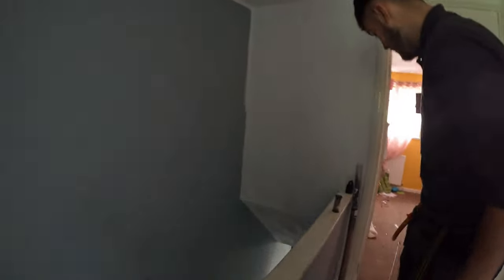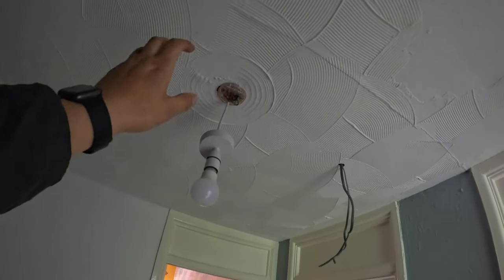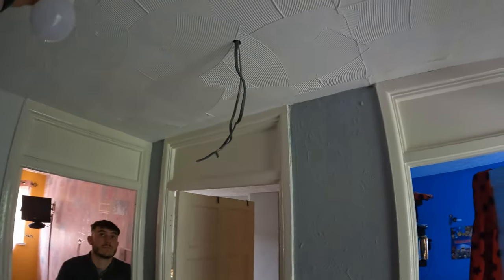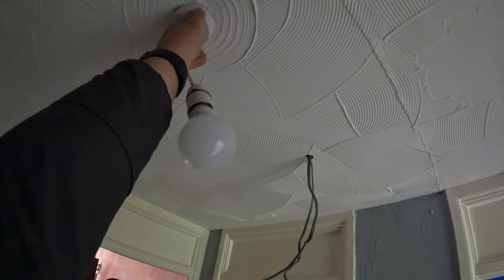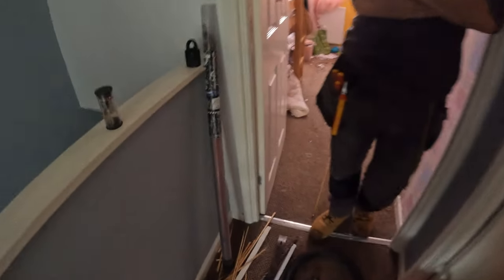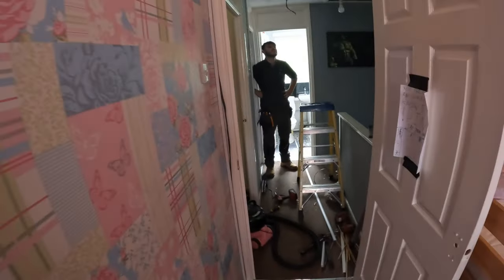Right, Layton's getting on with it. I've come back to check on him — he has just fitted the new pendant; we use Verso pendants for everything. Basically, we've got permanent live and neutral in, permanent live and neutral out, and then the switch line and permanent live going down to the landing switch. He's then taken another permanent live and neutral over to the smoke alarm position. He's also cut the cable downstairs nice and neat and relaid the floor — what a legend. The trunking is up with the cable inside.